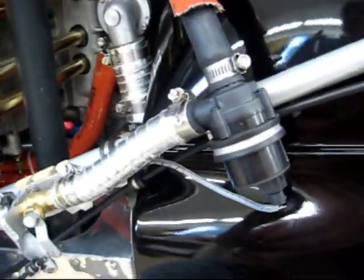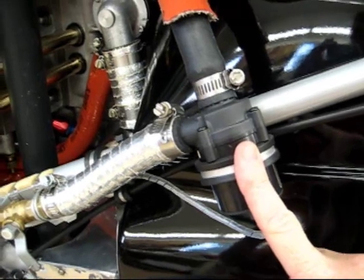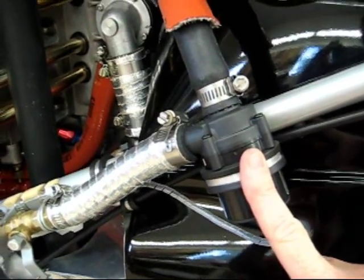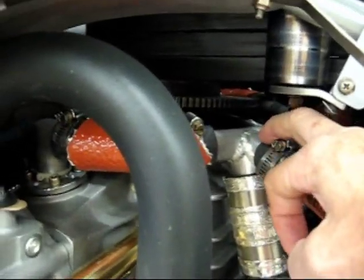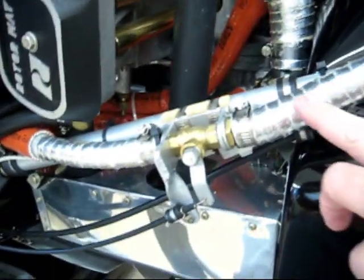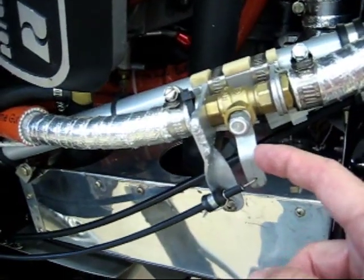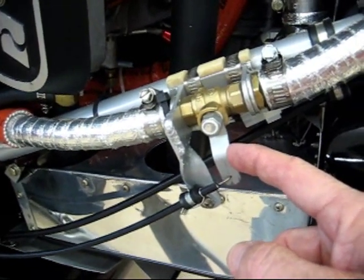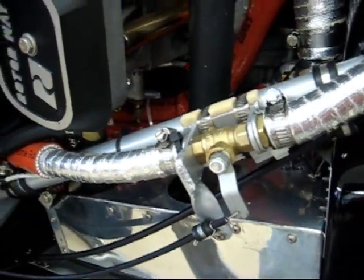This helicopter is also equipped with a turbo boost pump. This turbo boost pump sends hot coolant through the heater radiator and blows hot air into the cockpit, which gives me a nice warm cockpit in the winter. I did some extra welding here, coming off the hottest spot on the water jacket, pulling it down through the pump, and then down this line into the radiator unit. This also has a shutoff valve actuated in the cockpit, so in the winter when it's really cold outside I don't have the fluid bypassing the thermostat.